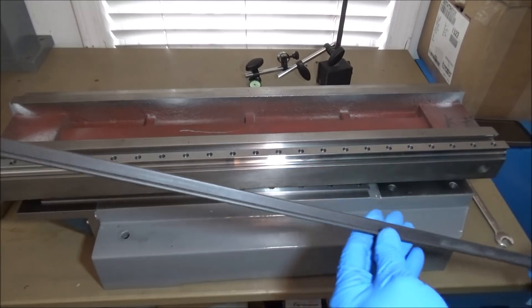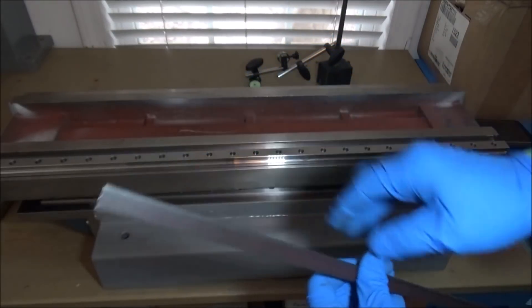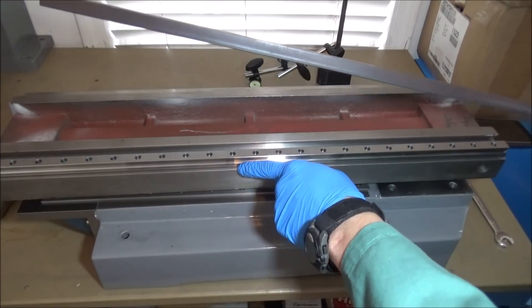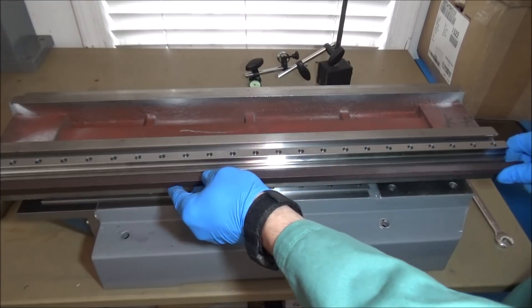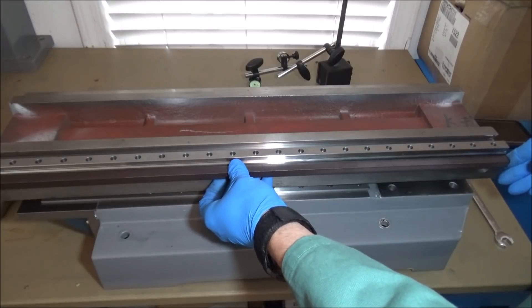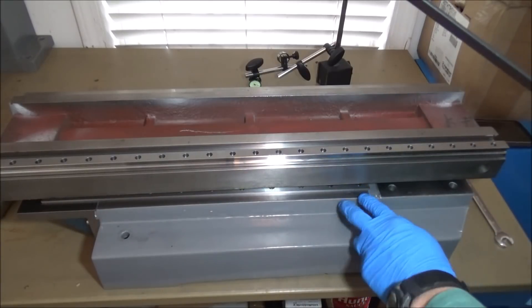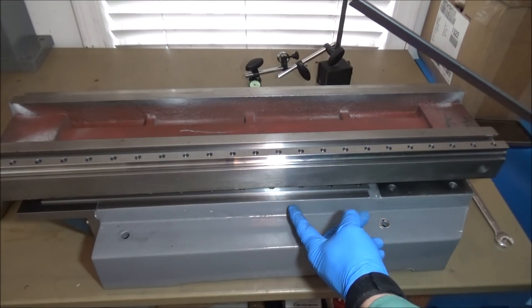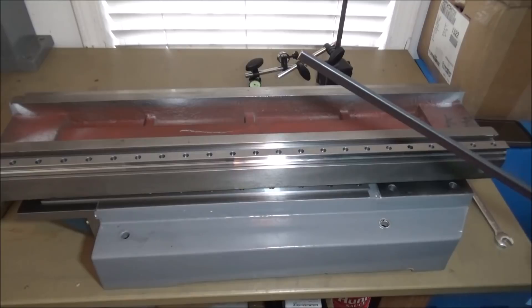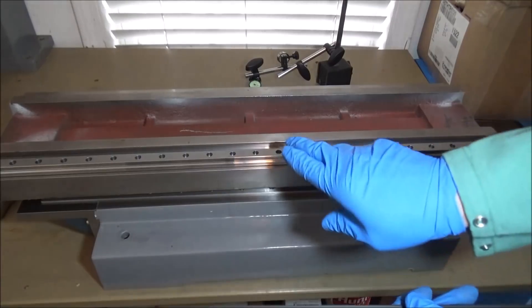What I've got here is some half-inch by half-inch angle iron, and I'm going to machine it down so it's just a little bit wider than this gap here. Then I'll bore holes through it and drill and tap into the table to clamp it in place — I'll do that on both sides. That's what I'll do for the X-axis. For the Y, they're pretty much flush with the edge, so I may just use some type of washer, bore some holes, and use the washer to press up against that. I'll use something similar on the Z-axis too since it is inset just a little bit.